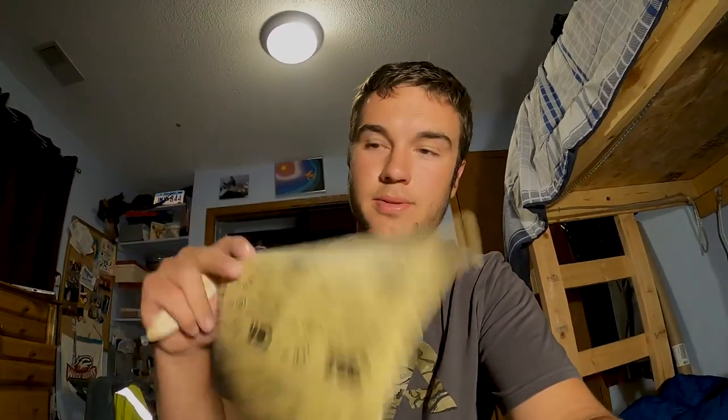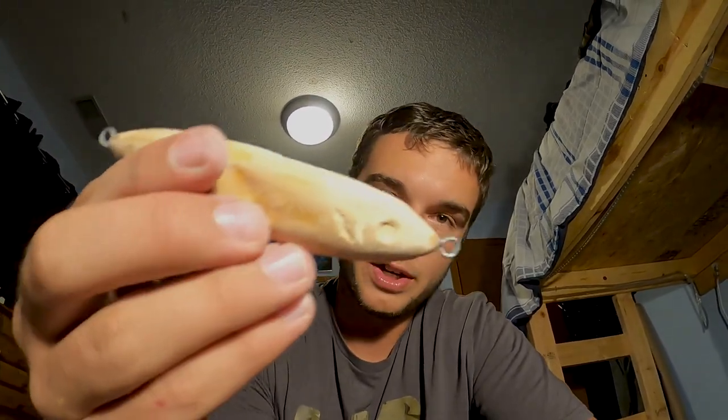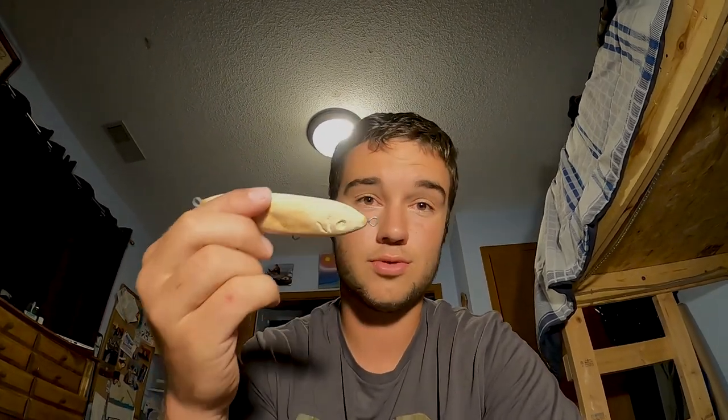So what I just did was I used my 60 grit sandpaper and did a lot more of the hard sanding on the spots where I used the super glue and the epoxy. And then I took my little knife and my little carver and I carved in some details here. And then finally I took my, whatever it is, 120 or 100, I lied, 150 sandpaper and really finished up the edges so it's nice and smooth. And now this thing is ready to be painted. I'm gonna wipe off all the sawdust, blow off all the sawdust, and I can get going on painting it.